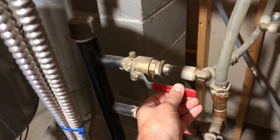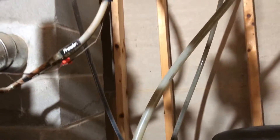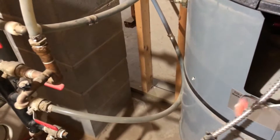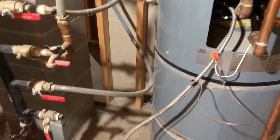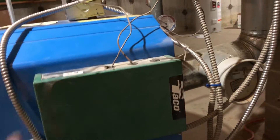And the same thing here - I'm going to turn off my valve that comes off of my boiler on both sides. One is a supply and one is a return; they're clearly marked. I'm just going to shut those off and cap them off. The last thing I'm going to do is disconnect the electronic leads that go to the thermostat in here, because if not, as the water starts to drop, the thermostat's going to kick the boiler on, and I don't want that to happen. So I'll disconnect those leads and open up this box and disconnect them in there. That's basically it to getting rid of this indirect hot water heater.